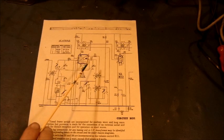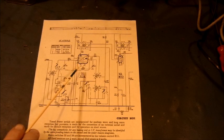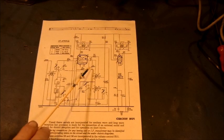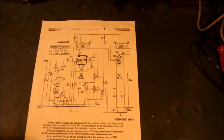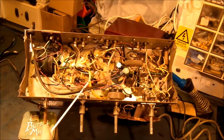Now over to the local oscillator including the triode side of V1. Tuned coils L7, L8, L9 and L10 form the local oscillator which is ganged with TC2. The oscillator varies as the tuning is adjusted. S3 and S4 are the wave change switches. Here the oscillator runs at 470 kHz above the tuned frequency. The oscillator minus the received signal will run at 470 kHz regardless of where the tuning capacitor is set. This is the IF or intermediate frequency. Now back to the radio chassis.